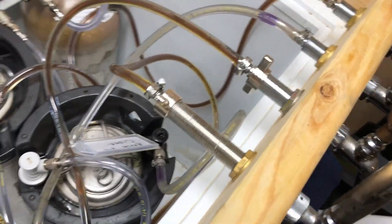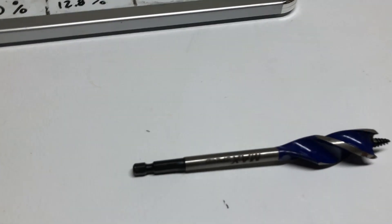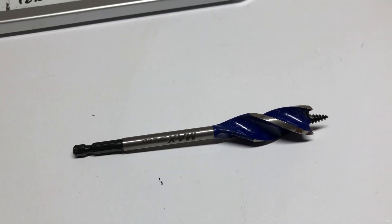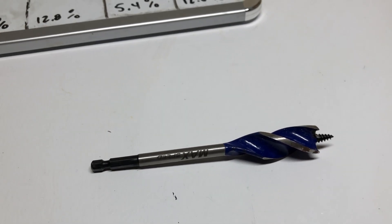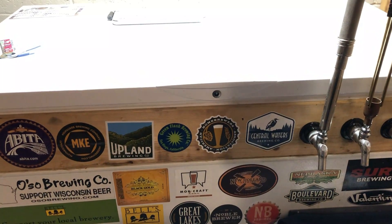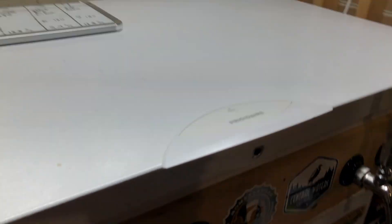When you have your faucets, you determine where you want them and drill a hole. I use one of these boring bits — it's three-quarter inch in diameter. You can also use a spade bit, which has a rectangle with a point on it. I find them easier to use and I think they go through cleaner. When I first got this kegerator, I only had one tap and I thought it was really clever to put a hole right there — in hindsight, that was really stupid.